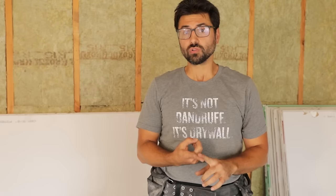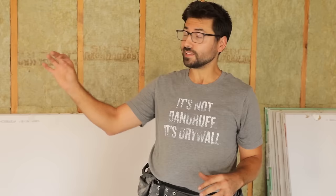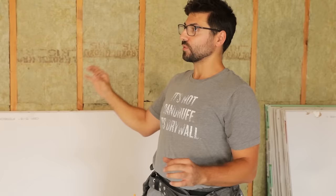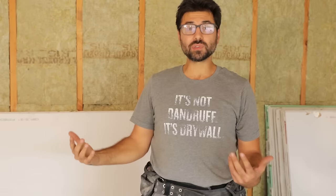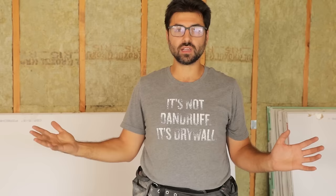I also screw everything. A lot of people tend to nail the perimeter because it's a little faster and nails are less expensive than screws. Just screw everything. If you ever walk through a house and you see those little circular humps that are random every once in a while, that is called a nail pop. Now to avoid that, don't use nails. Now a lot of people say if you nail around the perimeter and you tape your seams, the tape is going to hold those in. Over time, eventually, it can work itself out. So if you screw it in, there's no problems. It's a little bit more expensive, but it's also a better hold.